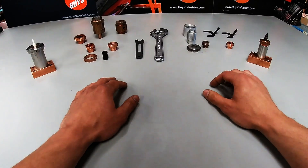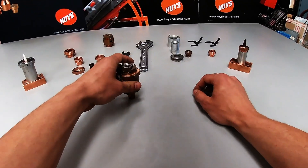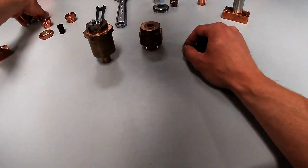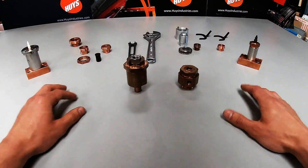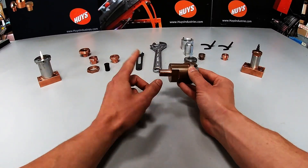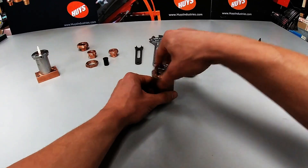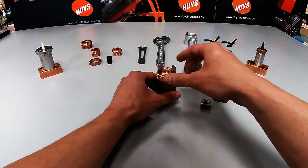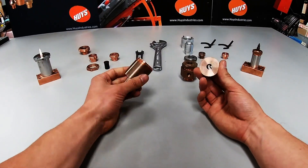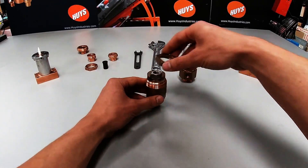A couple of custom applications include a tapered base or a custom thread, as well as the 400 series for larger applications. We can always make adjustments for whatever application you're looking for. This particular one was a 5RW taper with some flats, and they wanted to keep a positive location for the nut. Take the standard nut off and that's your consumable right there. The advantage is that you're not replacing a lot of copper — you're just replacing the weld face, which keeps cost down as well as waste.